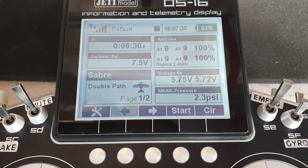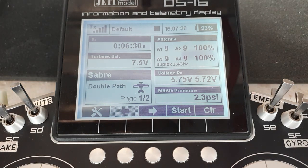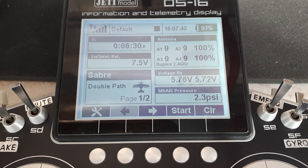This one we're going to look at Jeti and the Xicoy telemetry adapter, which brings you telemetry straight from the jet engine ECU that uses a Xicoy ECU with the newer style servo plug for connecting your ground data terminal. If you've got the older style with a little telephone jack, maybe they make one for that, but this is for the newer one. And lots of different brands of engine use the Xicoy ECU. In this case, it's a Wren engine using an up-to-date Xicoy.